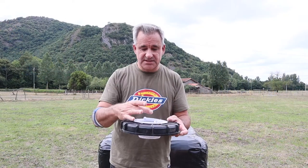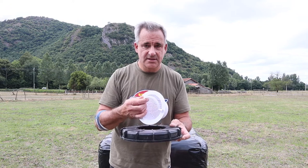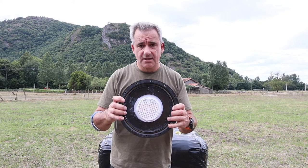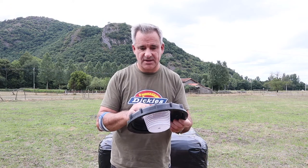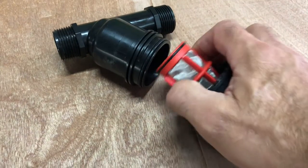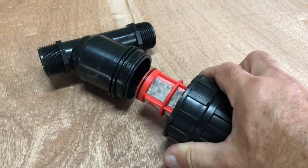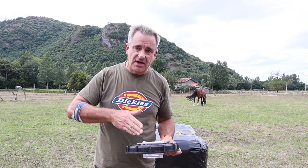The downpipe should just sit in there nicely and I should be able to just get that out to clean — throw all the leaves out and things like that. The holes aren't too big or too small, because if they're too small it'll just block up straight away. I'm going to have another filter on the outlet that will take out all the tiny things to stop blocking the pipes in the polytunnel, and also any bugs for the horse.